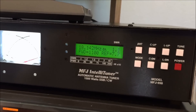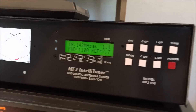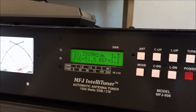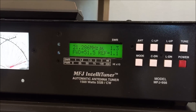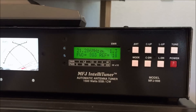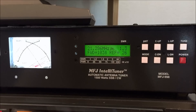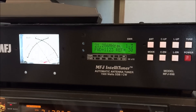I never tried it. It'd probably take a lot longer than that though, wouldn't it? Oh yeah, definitely. Let's go back now to 15 meters — let this thing retune on 15. With 50 watts of drive you're looking at roughly 550 watts. Let's go up — at 80 watts of drive, that gives me 1100 watts. 1.3 to 1 on 15 meters on your beam.